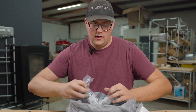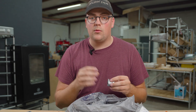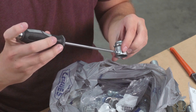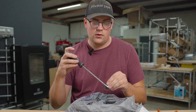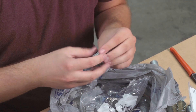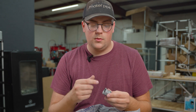Next up is another connector, very similar to what we talked about earlier, except this is the second style. With that compression connector, it had a ring on the inside that you tighten with vice grips. This is the other style — a set screw connector. You put the conduit in and then tighten this Phillips head screw into the conduit and it cinches down on it. Again, this is a connector, so one side is meant for the conduit, the other side goes into an electrical box and has the nut to secure it. The main difference from the previous one is the type of connection — this one is set screw, the other was compression.